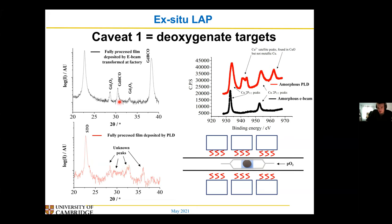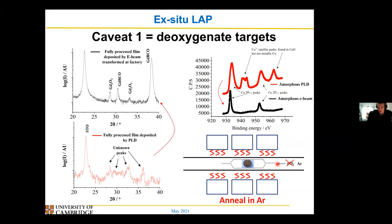This is probably why these unwanted phases were forming instead of the ones we wanted, because once you've got lots of oxygen around and start heating it up, things start to crystallise before my liquid can form. And if my liquid doesn't form properly, I'm not going to get the reaction to form my gadolinium 123 phase. But the way to get around that was simple: you just have to anneal your targets in argon instead of oxygen.